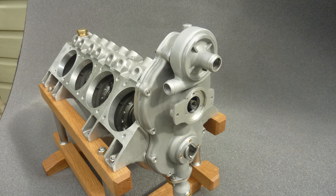Many people comment on the beautiful copper-clad cylinders. These are the thin water jackets made by electroforming, the result requiring no rubber seals. The technique was well known to Victorian sculptors and engineers, but expensive and complicated to do. I found it very difficult, but got there in the end. The induction pipe work was done in the same way.